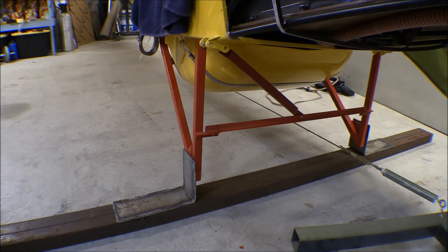The idea of using the angle iron to bolt up to that didn't work once I could see how deep the gear was up there to the mounting hole. So I got to trying to find something else. I happened to have this other angle iron — I don't know where it came from, but it's 10 inches by 6 inches and 3/16ths thick. I found a piece short enough to handle, took the torch, and cut off two 4-inch wide pieces. I decided to put the 6-inch piece up on top — it'll be a little stronger against bending — and the 10-inch piece will be welded out there to give a bit more lateral strength.